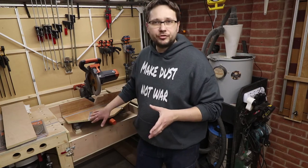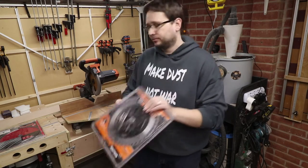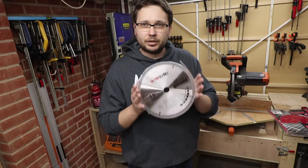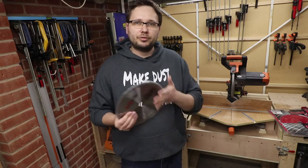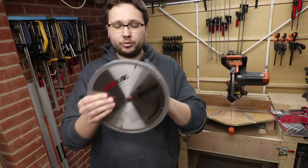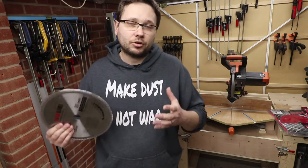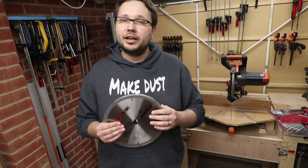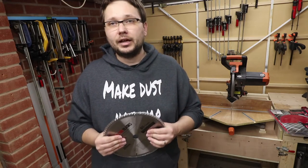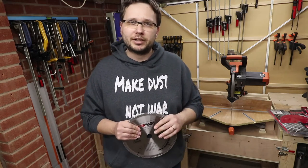What blades are we going to be using? Obviously the standard multi-blade from Evolution, a wood-cutting dedicated blade from Evolution, a Freud blade 60 teeth, and finally a Saxton blade 80 teeth. Now one thing you have to consider before buying any blades for your Evolution tools — all the Evolution saws have a bore size of 25.4 millimeters, whereas more or less all standard blades have 30 millimeters. It's very difficult to find blades with that bore size that fits Evolution saws, and probably that was a step by Evolution themselves to point you toward their own blades rather than anybody else's.